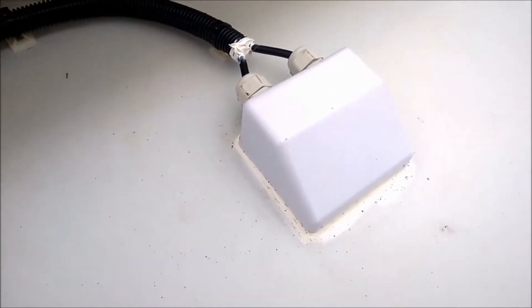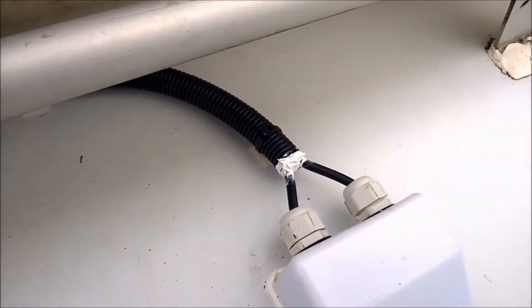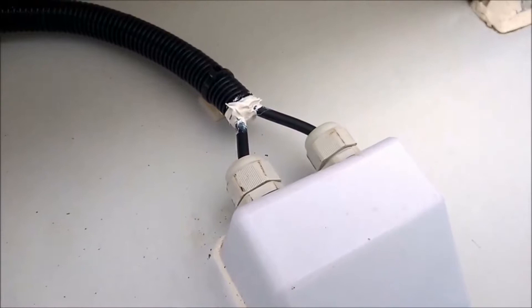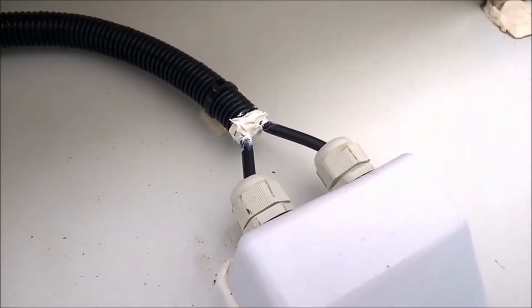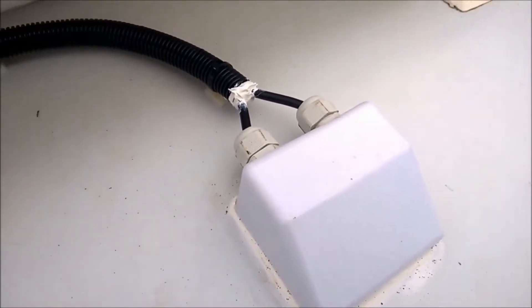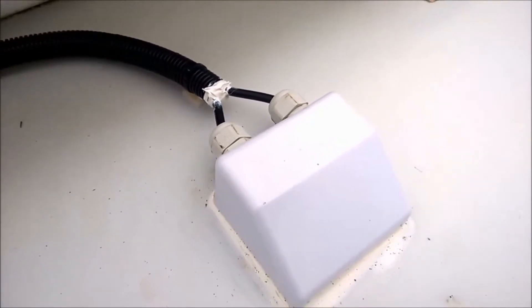Unfortunately it's been a windy day — we've got some black bits there which I'll have to try and clean off later. And then to stop water going down into the convoluted pipe, I've just stuck some Secaflex in the end there. So that's the roof all done. It's going to rain tonight again so I'm hoping that will be waterproof.